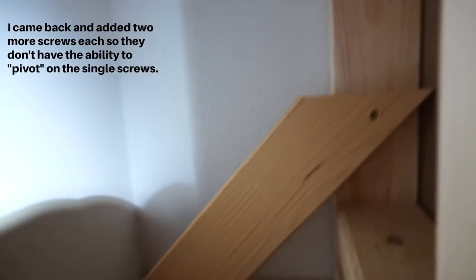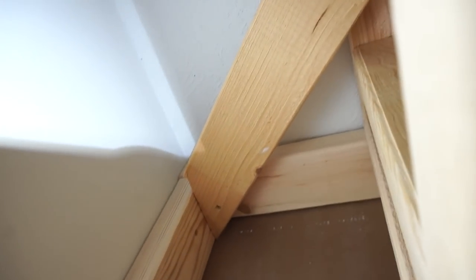So I actually screwed the frame — the 2x4 studs — to the trusses in two places, then attached the drywall. After the fact I realized I probably shouldn't screw these to the trusses, so I got inside the box and removed those screws. In order to structurally support the corners at the top from wiggling, I added some braces. I screwed a 2x4 from the back section into the front section at 45 degrees — a little brace on each side — which would be a lot easier to do before adding the drywall.